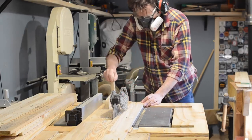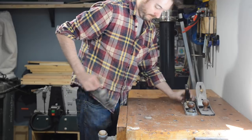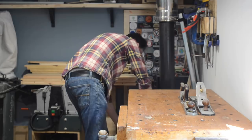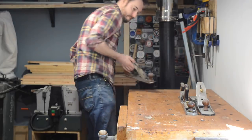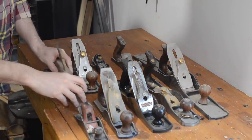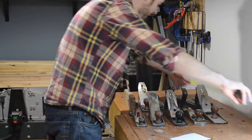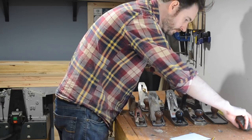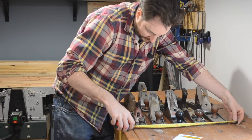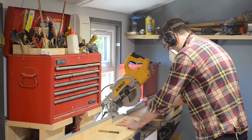When the glue's set I can rip these boards down to 14cm — that's the width I want for the racks — leaving me about 100mm left over for something else. To determine how big and how many shelves the rack needs, I'm going to lay out all my hand planes in the order that looks best or is most efficient for storage. If you're interested in more details about my hand plane collection, I've started a second channel, Badger Bites, with behind-the-scenes details and tool questions. Click the link at the top or below and subscribe if that sounds interesting.